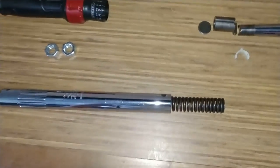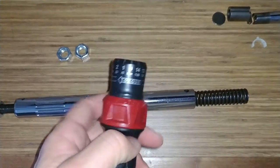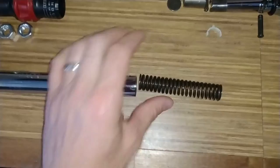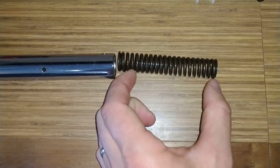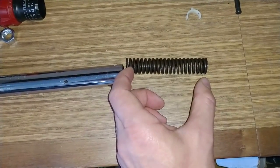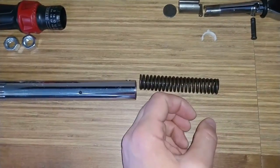One thing I remembered from reading: on a click wrench, always take the load off and turn it back to zero — set it back to the lowest setting. On some of the larger ones it says 'stop,' on others it says 'zero.' You want to screw it all the way down. The reason is that when it's screwed up, it's pushing that rod in against the spring, compressing it. With the spring continually compressed in storage, it will shorten over time, putting a preload on it, which weakens the spring and changes its length — throwing off your calibration. So the handle needs to be turned down to zero so the spring stays fully at rest.